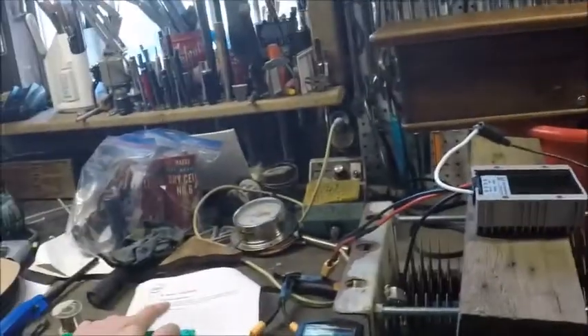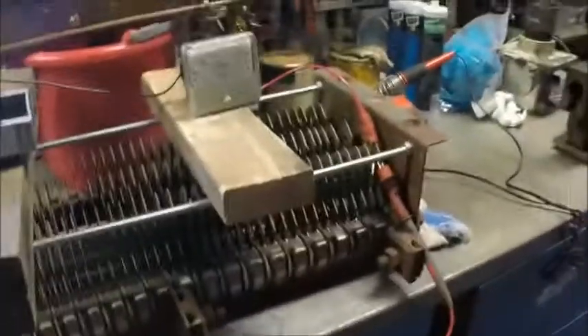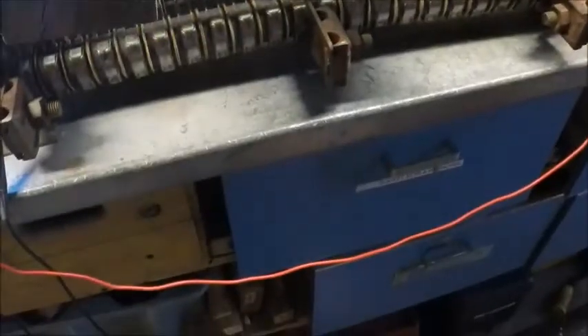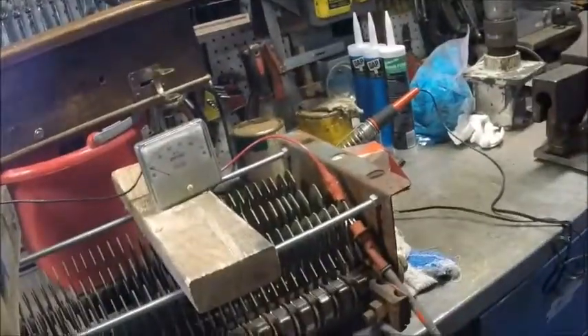As long as it meets the ATX requirements between 0 and 20 amps, it's good enough for a graphics card. I'm planning on getting a GTX 1060 6 gigabyte — I was thinking about the ASUS Turbo GTX 1060. Supposedly a 20 amp supply on the 12 volt rail is sufficient for the 1060. That's what I'm testing, so let's try it out.